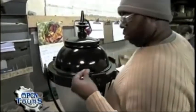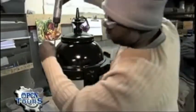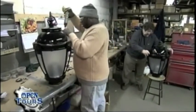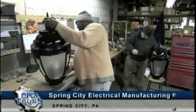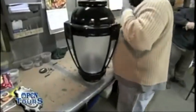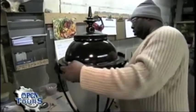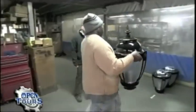This particular fixture is a horizontal lamp application, and we achieve certain light distributions in a few ways. We start with our engineering side of the company, with the photometric engineering and design of the reflector systems. We disperse the light through refraction using internal refractors. This particular luminaire has a hydroform reflector in it, and Todd will bring it over to show us.